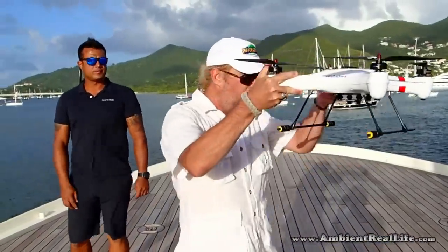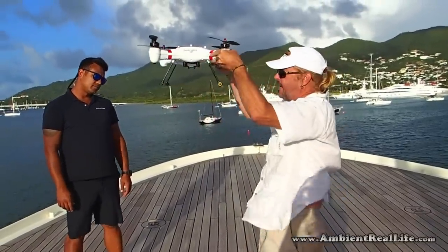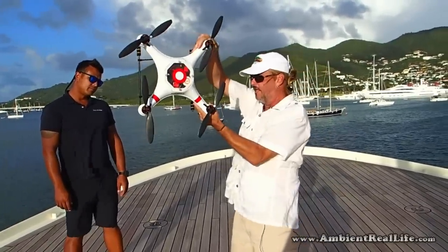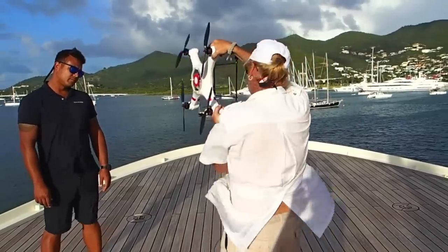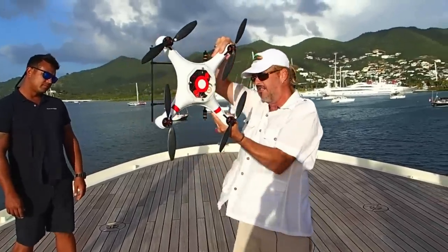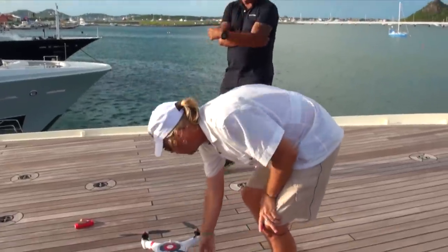And I can do a rotation around my body just like this. Watching the light, still yellow. Okay, now it's flipped to green, so we flip it forward 90 degrees and continue rotating. Still green, and when the green light goes out, just like so. Okay, so the green light is out, we've got no other flashes, and that's calibrated.